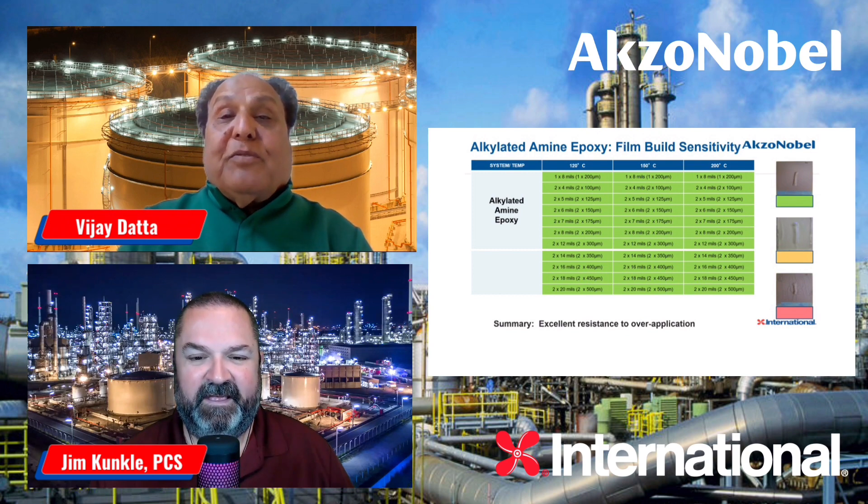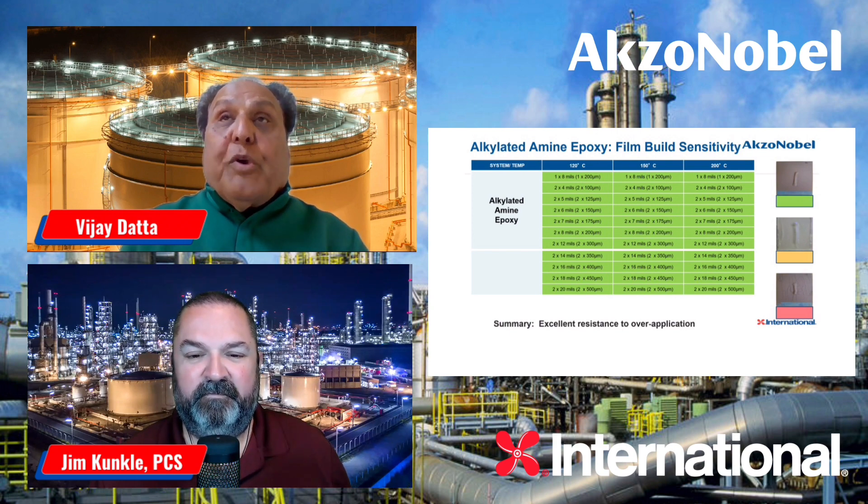What you see in this picture is on the left-hand side green color plates, in the middle is yellow, and on the right-hand side is a reddish or pinkish color. We took the traditional epoxy phenolic coating and applied it at several different film thicknesses. These coatings were cured seven days at room temperature, then we heat the panels for eight hours at target temperatures — 250°F, 300°F, and all the way up to 400°F — then cool for 16 hours. That makes one cycle. We run these panels for several cycles to see if there is any cracking at different DFTs.